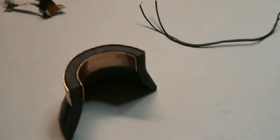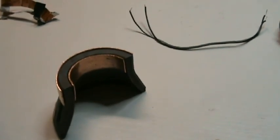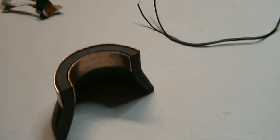So next is the inner ring. Made some markings already, so going to that now. Okay, so after some fiddling and bending and measurements, this is the result. I have two copper plates, one on the inside of the yoke and one on the outside. So I have to isolate them now from the yoke with some isolation tape, and we'll make some measurements about capacitance first before I join the one side and the inductance.